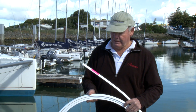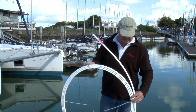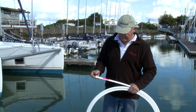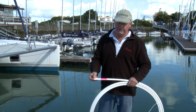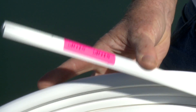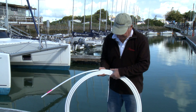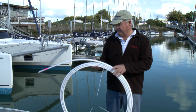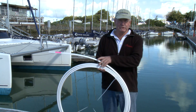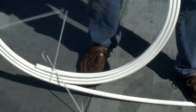One of the first steps in unpacking the furler and getting ready for installation is to uncoil the furler extrusions. A couple of cautions: the bottom of the back extrusion on the CF-500 is marked with a warning label that says don't cut here for obvious reasons. When you're unpacking these, they're tied up in a coil with tie wraps around them. You have to be very careful because they are spring-loaded — control the release one snap at a time as you uncoil it and let it rest on the dock so it loses its memory of being in a coil and lies in a straighter line.